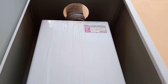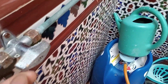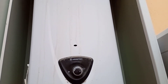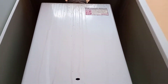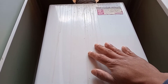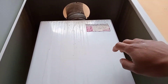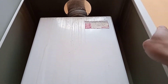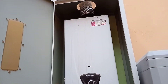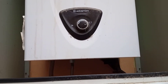I think the reason why this stopped working, other than the batteries needing changing — I did find the gas supply off, but that's because the customer likes to turn it off just to prevent any unforeseeable gas leak. But I believe the reason why, as you can see here, is that there are a lot of signs of water. It looks as though rain has been coming in and getting into the unit, and the case isn't really designed to stop the rain. So water got inside, and got the burner wet, and it had to dry out first in order for it to light.